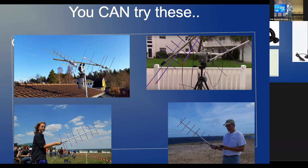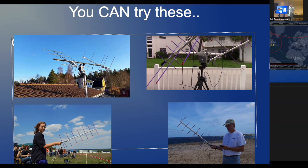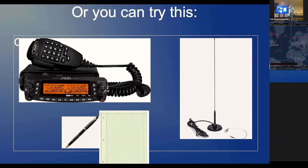Many videos show these really cool Arrow antennas — Arrow is the manufacturer — with a handle on one side. People use a Baofeng or similar at five watts and rotate the antenna to compensate for the polarization of the moving satellite. Some people get fancy with tracking setups on tripods or roof mounts to actually track the satellite. But we were going for as simple as it gets — just a mag mount antenna on the vehicle.